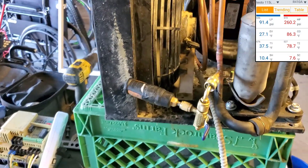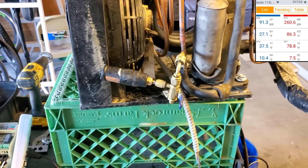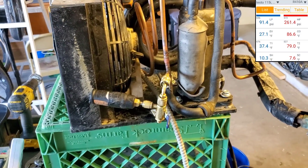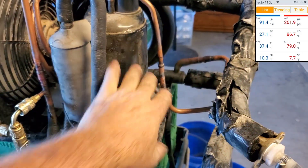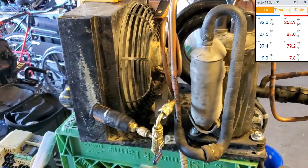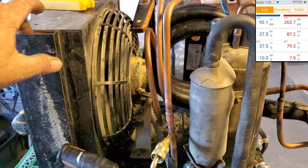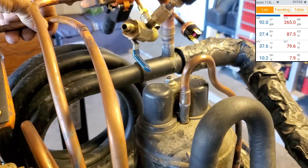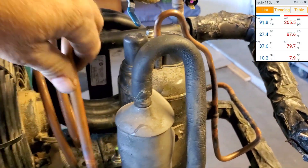Head pressures are nice — now it's only at 260. This will be — well, I did the experiment with this compressor in the portable AC unit that it came in. I kind of adapted it, so this evaporator would be a little bigger than when it was in it. Oh, I'm actually getting a nice cool suction line now. Remember before it sucked? So I've got 10 degrees superheat. That's nice.